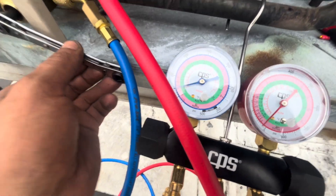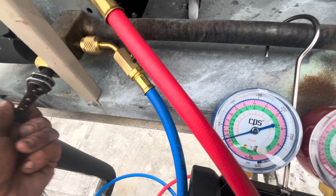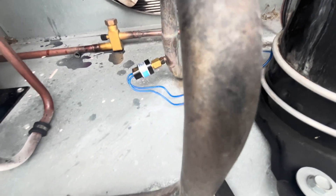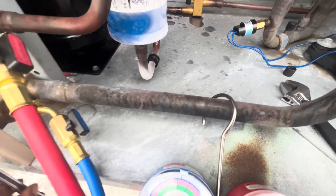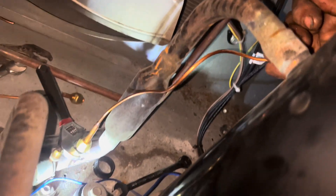It's going to be very minimal pressure and very minimal refrigerant loss. I won't have to pull a vacuum, nor will I have to add any more refrigerant when I'm done. All I have to do is open up the valve on the receiver, open the suction line valve, and turn it back on — and in theory that works perfectly every time. And it did — I was able to change it on the fly with very minimal pressure and barely any refrigerant lost.